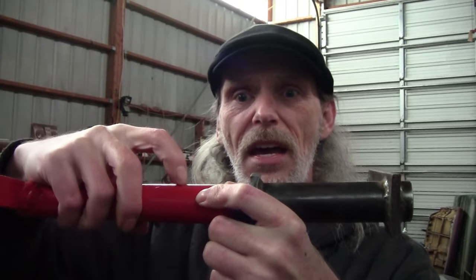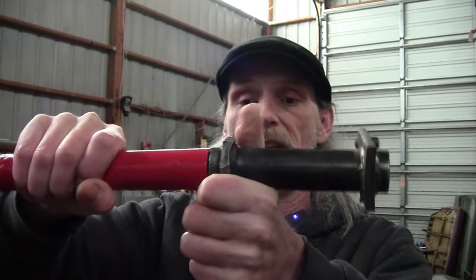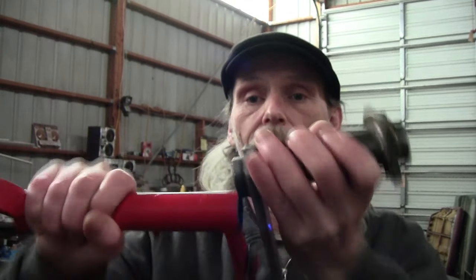Then in the holes that I've drilled, I'll do a big, heavy plug weld. Over on the other side, another plug weld. That'll keep it nice and strong so it can't twist apart. Then in the center here, I'll do my butt weld. A butt weld is actually very weak, though, so I won't rely on just a butt weld. The strength is actually coming from the inner sleeve I put in there and those plug welds. The plug weld not only keeps it from twisting, it keeps it from pulling apart, and because it's sleeved like that and backed up with a continuous weld in the seam, the butt weld, it can't twist apart this way.